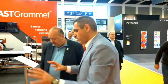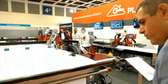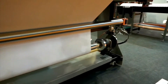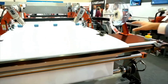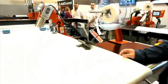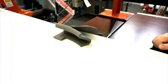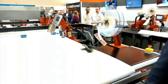Then we come to the machine — we load the roll. We have an air shaft, same as the printers. So we load the roll over there and then pass it through. On this gray part you can see on both sides what we do — we start creating what we call the hem. We start pre-folding the material. That basically creates a fold. We have the guide from the welder afterwards that helps to create the fold in the hem.